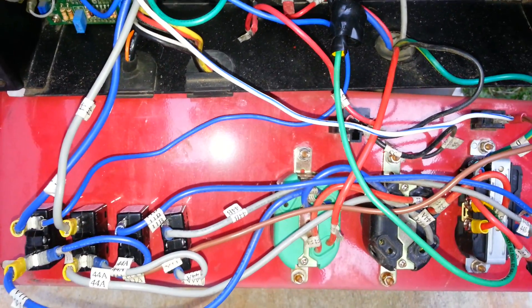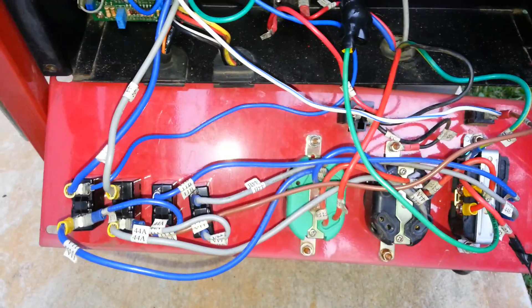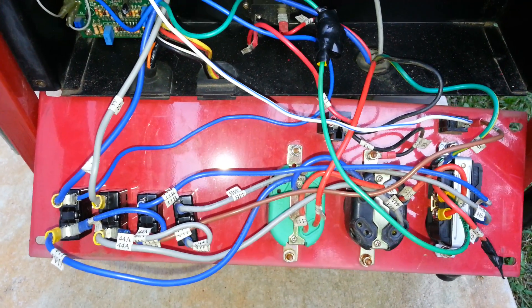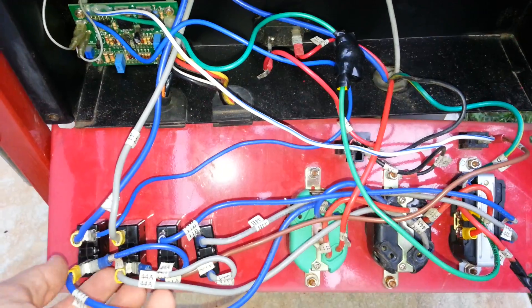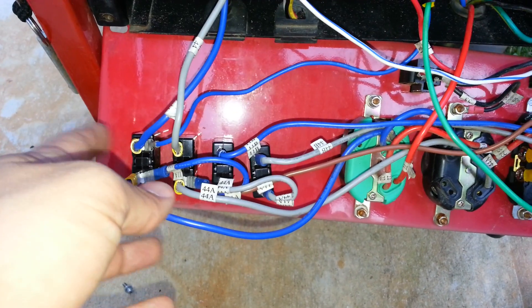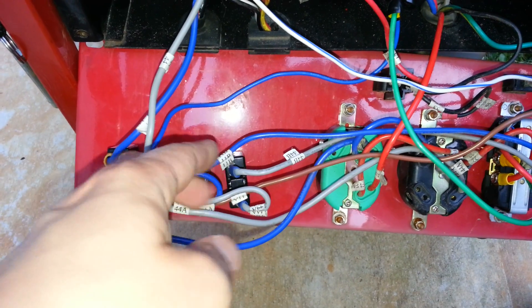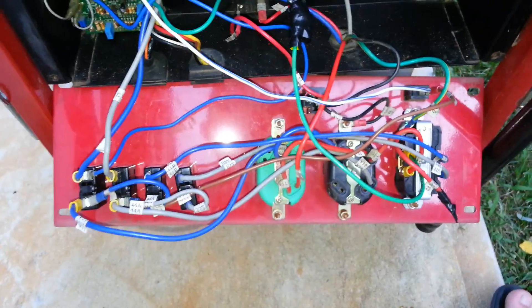If you have any questions please feel free to message me. I'll leave comments open — I know a lot of guys will have these machines and quick questions about the wiring. This is kind of a general overview. Be aware of loose connections — that's where a lot of high resistance and voltage drop comes from. It's better to go and recrimp a brand new spade connector than to just re-bend them; re-bending is only a temporary solution. All the yellow connectors I replaced when I rebuilt the generator; the blue ones except for the two I just re-bent have also been changed. Thanks so much, please subscribe, and have a great day.